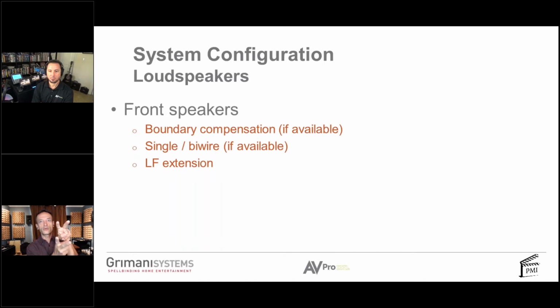So I've seen a lot of systems where somebody bothered putting two sets of wires for low frequency and high frequency, and then the little connection bridges are still on. It's like, well, wait a second. That's too bad. It's still better because you run more copper from here to there, and it's all about lowering the resistance, but it would have been better if you could actually isolate those two things.